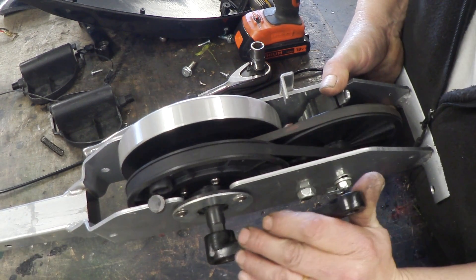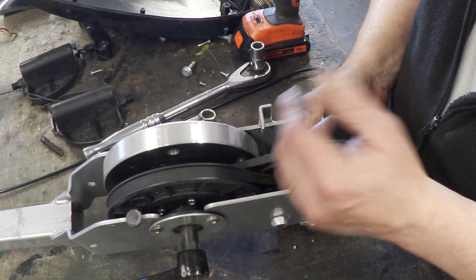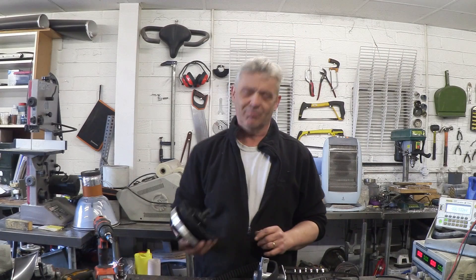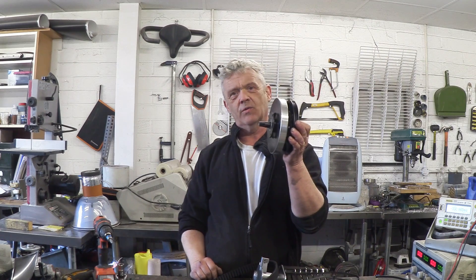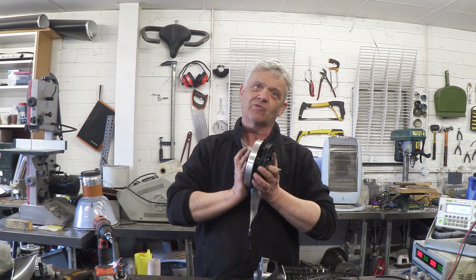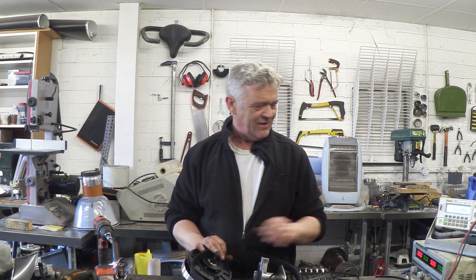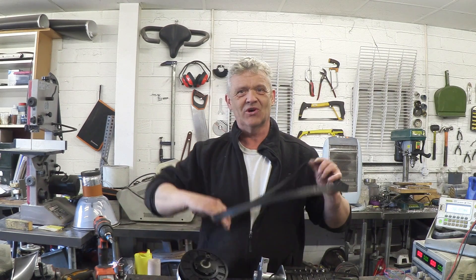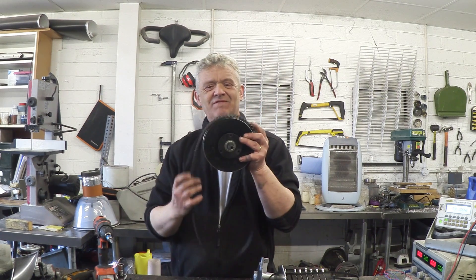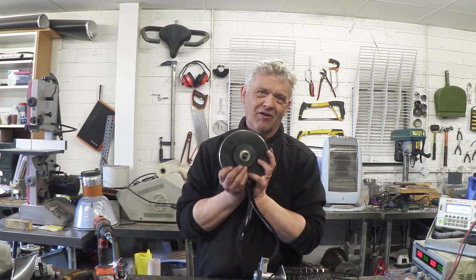I turn that quite slowly but the flywheel turns really quite quickly - so obviously we've got the mechanism we need. If we can attach our motor somehow to this point, when we turn slowly the motor will turn fast. I've got the whole thing to bits - there's the flywheel free-spinning but driven by that belt. We've got to connect that to the motor in a robust manner. I went to see our mates down at Canterbury Auto and they gave me a really sturdy toothed belt that fits nicely around there.